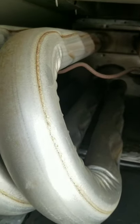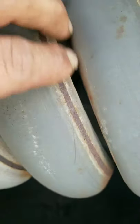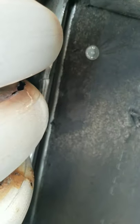I had a feeling, even though the heat exchanger looks like it may have been replaced at some point, it's been a few years. We got some rust but no parts here. Right there on the corner, it's just eaten up all to hell. Same way there. So they need a heat exchanger too.